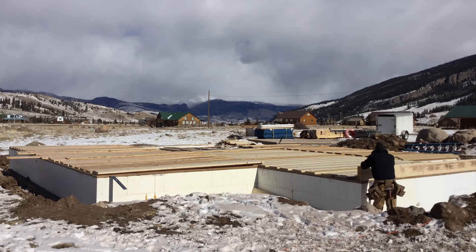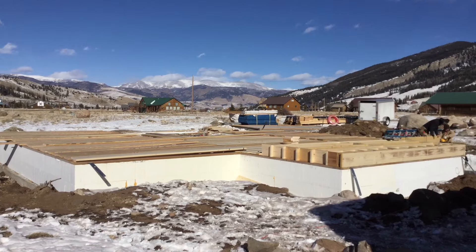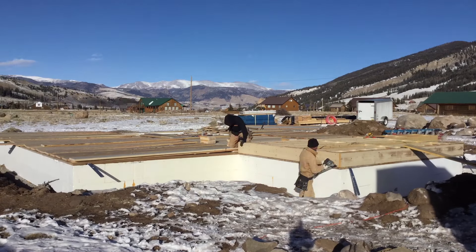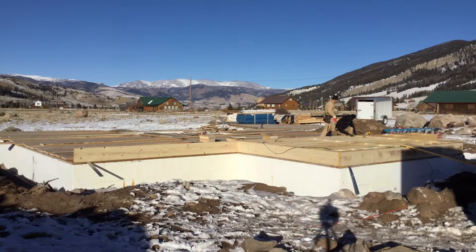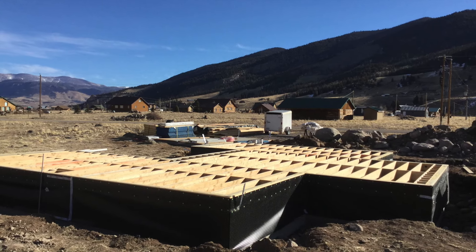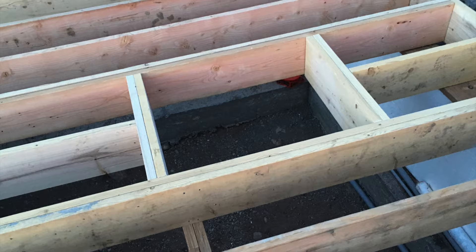He's an easygoing guy, former military — Merchant Marine. I wanted to show you the detail on how I framed up the point load under this front wall. I'm a SIPS builder and an electrician, and I've been a framing superintendent for a while. The way you run electrical in a SIPS wall is through the crawl space — through the bottom in conduit. This is an eight-and-a-quarter-inch thick closed cell panel, R54, and 17 feet tall. I needed more bearing than just the rim joist's inch and a half, and I needed access to run the electrical. This wall faces south to take advantage of solar gain and also faces the predominant wind direction. We get gusts here at 90 miles an hour, and this is built and engineered to 132-mile-an-hour gusts, so I didn't want it bearing on just the rim joist.